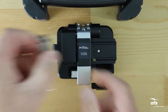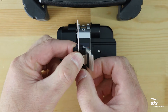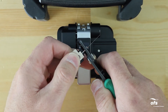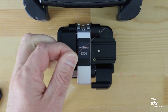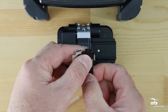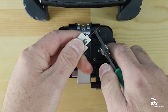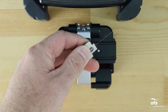Fiber curl facing down. You can also put fiber into the holder leaving approximately 30 millimeters of 900 micron and 250 micron coating from the end of the removable holder, then strip the 900 micron and 250 micron coating from the fiber leaving bare glass. Strip as close to the end of the holder as possible. If you are using 250 micron fiber coating, strip approximately 30 millimeters of 250 micron coating from the end of the fiber leaving bare glass. Strip as close to the end of the fiber holder as possible.